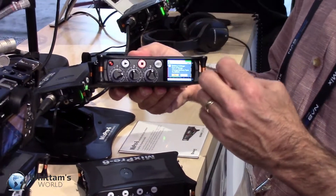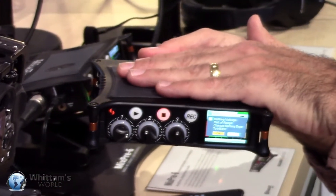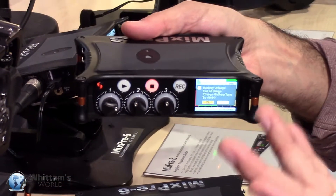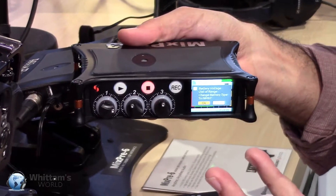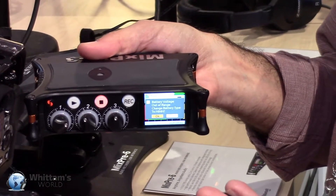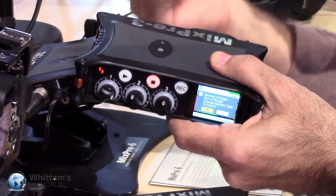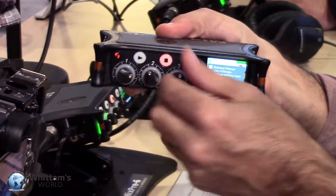The key here was recording, multi-channel recording, mixing, but also it's a multi-channel USB audio device. And that can actually work simultaneously while still recording to the internal media — that is a unique feature. It opens up all sorts of possibilities for backup. In a voiceover scenario where you're recording a long take and the computer corrupts the file somehow, knowing it's on the internal card as well is great. For podcasters who want to bring in voice-over-IP via Skype or FaceTime, you can route that USB source from the computer to a fader and mix those contributor sources with your own local mic.